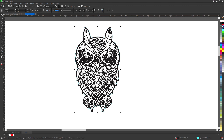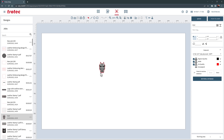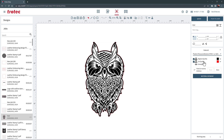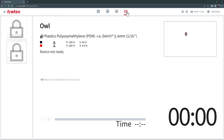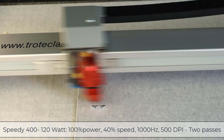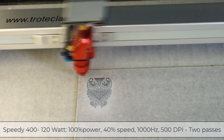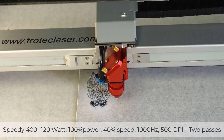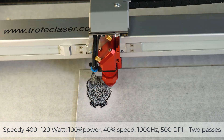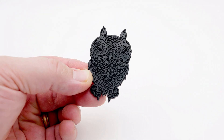Then apply a cut path closely around the drawing and save the design. Import that design into the Ruby software and place it into the prepared screen field. Select the Delrin material parameter and change the number of laser passes from one to two, then send that file to the laser. Place the Delrin plastic into the laser with the mask face up and focus onto the material surface. Start the laser and engrave and cut the design file into the sheet of Delrin plastic. This example is being run with a Speedy 400 120-watt laser at 100% power, 40% speed, 1000 hertz, 500 DPI with two passes and a two inch lens. Once finished, use a small wire brush to clean the plastic of any excess masking and plastic residue. The leather embossing die is now complete.